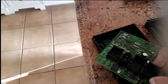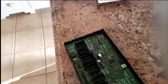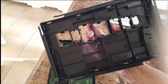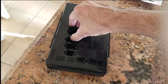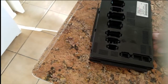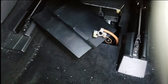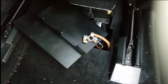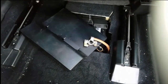Once you fix your SAM unit, just put it back in the case. Put the cover on it, clean it really carefully, get all the dust out, and snap the cover back on — it just snaps in place, no tools needed, just your fingers. Also, you've got to disconnect your battery before you unplug your SAM unit — that's very important. Slide the front passenger seat forward to get to the battery; it's under the front passenger seat.